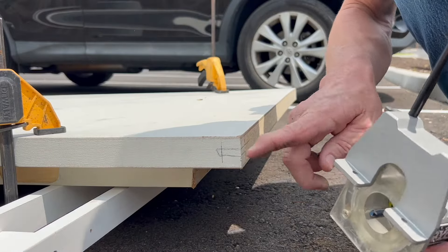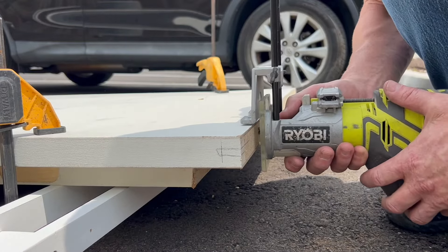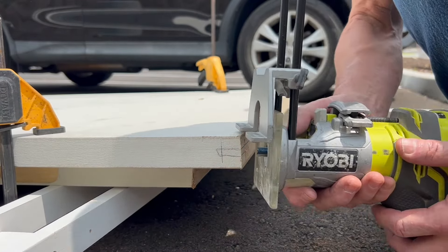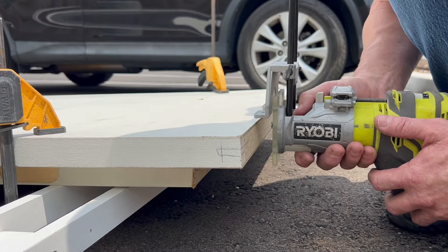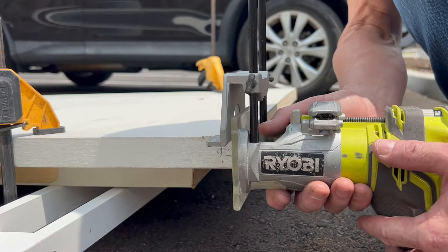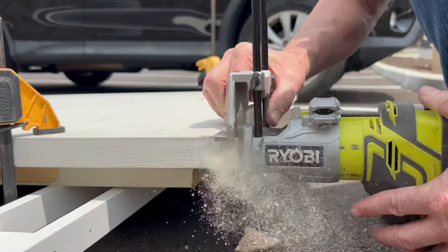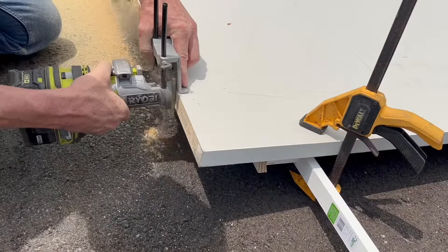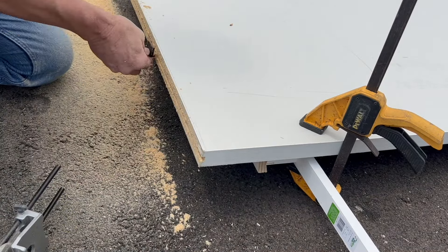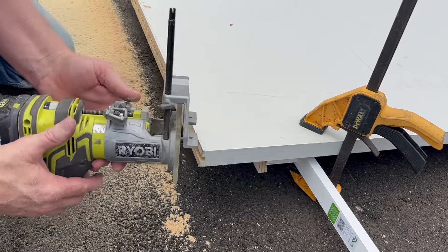I need to go as deep as this line. When starting, you have to come in from the outside. If I started at the other end and pushed the router out, I could blow out this wood. So I'm going to start here, go down to the end, and stop just before I get there. At the other end, I'll put the router outside and come in from the outside. I'm only cutting a quarter inch deep — don't try to cut the whole depth at once. It'll burn up your bit and you could blow out the wood very easily. Go a little bit at a time, quarter inch maximum. After one good pass, clean it out and take the bit down another quarter inch for another pass.